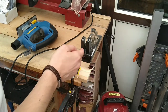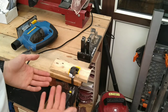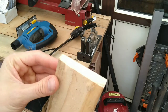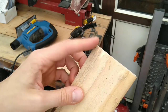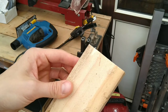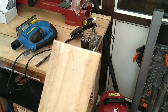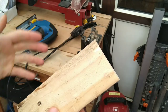Always wait for the blade to stop reciprocating before you put the tool down, just to minimize any accidents. We've got a pretty nice clean cut — nice and straight. There's a bit of splintering at the end where the blade exited, and it's not perfectly straight because I didn't use a square, but otherwise nice and clean. That's what's known as a cross cut — going across the grain of the board.